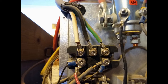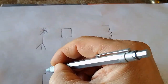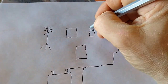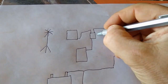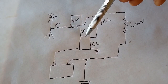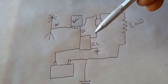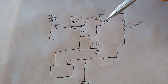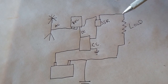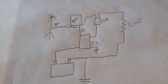After it comes down through the rectifier here, I'll do a little speed drawing to show you exactly how this is set up. Power comes in through the rectifier, goes to the charge controller, and that feeds power to the battery. If the charge controller doesn't need the power, it sends a signal to the solid-state relay, which diverts power around the charge controller and through the resistor load to ground.